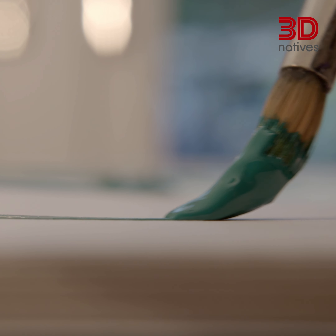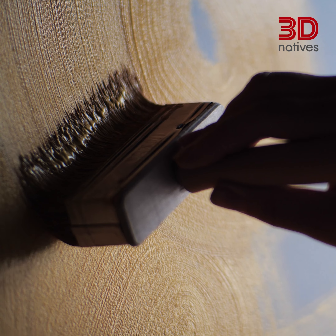Next, let's talk about line widths and nozzle diameter. Imagine you're painting a wall. If you use a thin brush, it takes forever but gives you fine details. A large brush? Much faster but less detail. The same goes for 3D printing. A large nozzle diameter can speed up your prints but might sacrifice some detail. So choose your nozzle like you choose your paint brush, based on the job at hand.